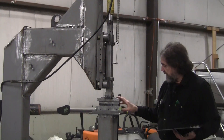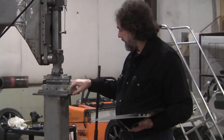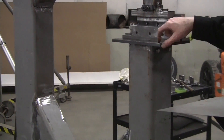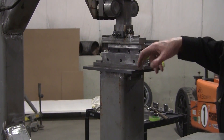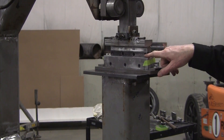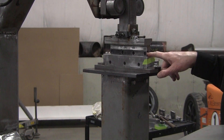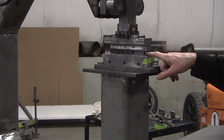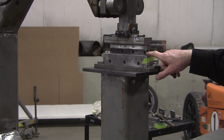This is the new eight-inch die. For it to work properly, the clearance between the cutting blades has to be about one or two thousandths of an inch. We made the whole thing here — I had some O1 tool steel and we have a little electric heat-treating oven. The O1 was pretty easy to heat treat and we get a nice 60-plus Rockwell. We temper it back in a regular home oven.